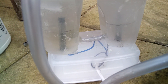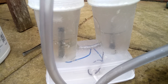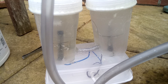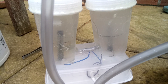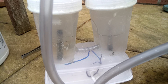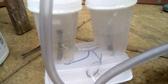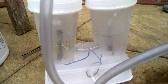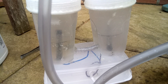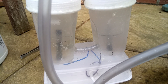It's just generally a poorly thought-out design. But this is my first generator that gives a good yield of oxygen gas — in previous ones the oxygen would react with the electrode plates, but with graphite rods that doesn't happen. This also means I could use this to produce chlorine gas by using sodium chloride instead of sodium hydroxide, but since chlorine gas is very toxic you do not want to do that — although it is potentially an idea for another video.